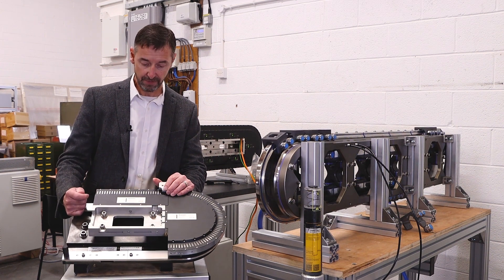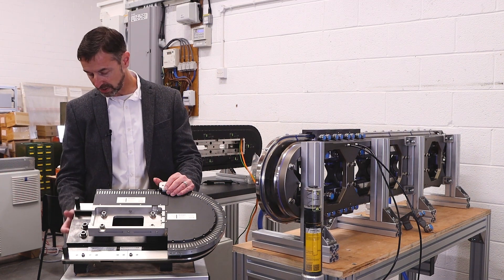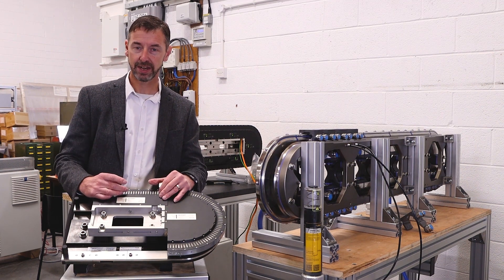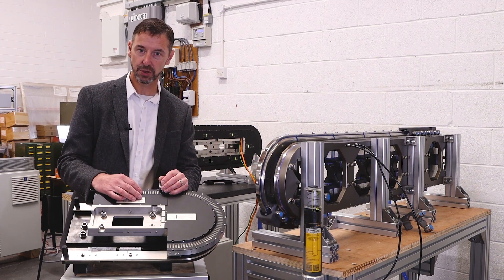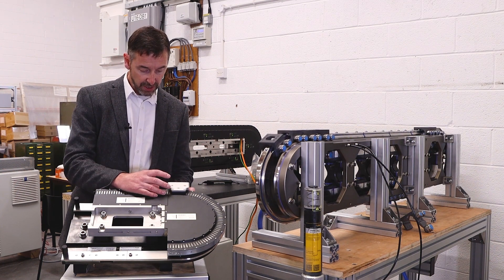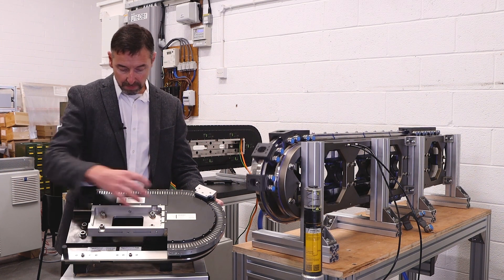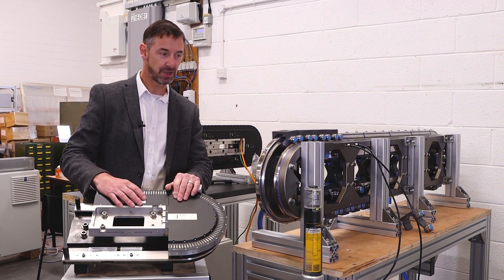The development with GFX has been unrelenting in the six years we've been doing it. We've developed modular base plates, improved the track technology — it's based on HEPCO Motion's V technology, which we've been doing for over 50 years, and this is really reaching the potential of V technology finally. The mover design has been optimised to make it stiff and lightweight, with axial stiffness bearings and modular motor mounts for the XTS motors. So let's take a look at some of the good stuff.